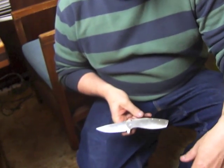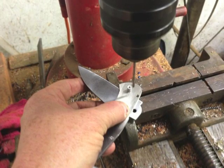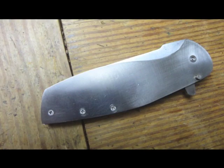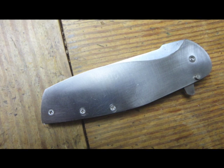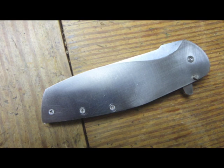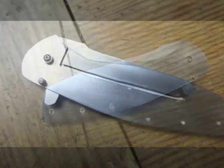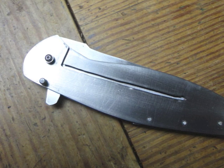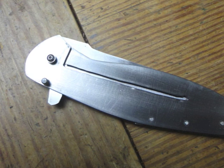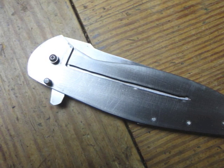I didn't show the process of drilling out the hole for the stop pin, but I put another paper pattern on, drilled that out, and stuck a 1/8-inch hardened steel dowel through the titanium liners — that's going to function as the stop pin. Those countersunk Phillips head screws look really good, nice and flush, which will be great for scales to lay over the top. I clipped off the screws and sanded them down flush, leaving them a little bit longer because I'll probably shim this spacer rather than make another one.